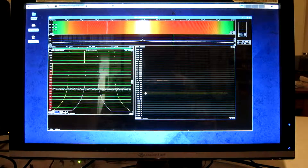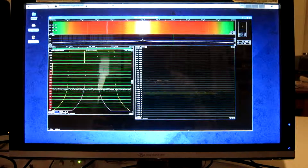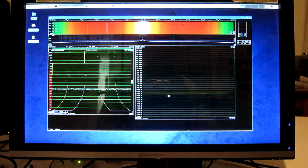I want this to show minus 116 dBm. The meter now reads minus 60, so there is an error of 56 dB, so I put 56 dB here.